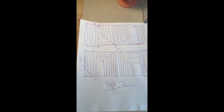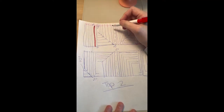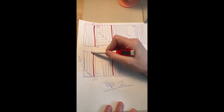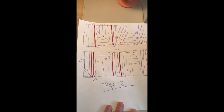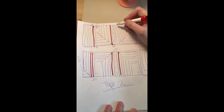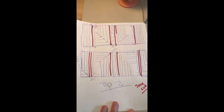And there's your pattern — it's basically the same for the bottom two drawers, just flipped and reversed. I'm going to show you how I number them. When you look at this, one is just going to be the same as that one, so when you're making all your cuts you can keep track. I almost lay them all out and number them 1, 2, 3, 4 for my drawers and then number your cut. All the way to the top at a 45 angle on each, just going different directions. For the red lines I really wanted you to visually see all the same cuts in the pattern and how each little section has the same cuts — it will make it easier when you're doing it yourself.